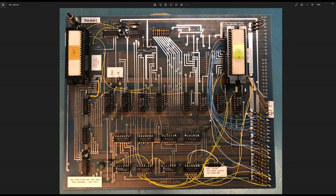Power comes in on these two connections. There's an electrolytic cap here for decoupling, and several 0.1µF decoupling caps scattered around the board. When I first brought the board up, the TIM monitor would run for a few seconds — maybe up to 20 seconds — and then fail, spewing garbage out the serial port. There was a lot of noise on the VSS and VCC rails, seemingly related to the clock. I added an electrolytic capacitor between the two ICs and added 0.1µF decoupling caps on the back side of the board for both of those devices and for the TIM chip.